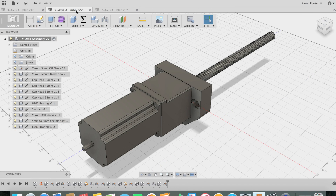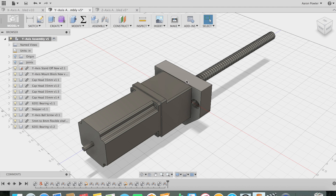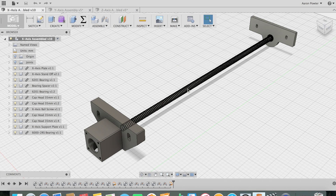I've got the Y axis assembly here first. This is quite straightforward when you're assembling it to your milling machine — you just have to trim down the end of the ball screw and drill a third hole underneath. For the X axis, you've got to trim down the end of the ball screw and remachine the 10mm flange end on that side. You also have where the ball nut screw lies on the shaft — you need to machine a little slot in your saddle to fit it in.